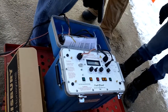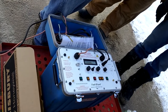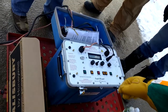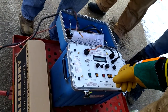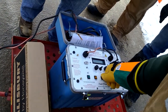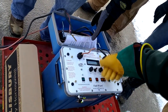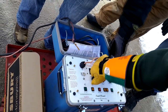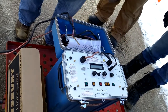Now that we've found the footage to the fault, we're going to have somebody walk out there and listen for the cycle thumping. Go ahead and switch it over to cycle thump mode. Hit stop ground and get used to doing that. Return it back to zero. You can hear it clicked when you went to cycle thump.